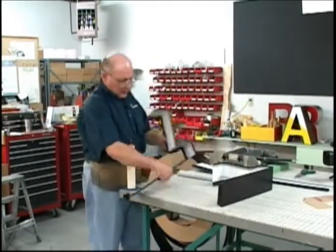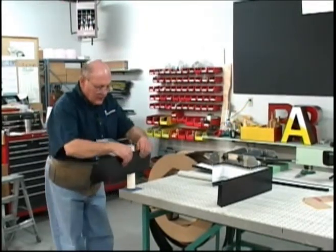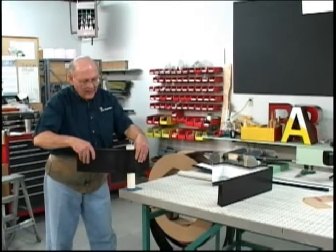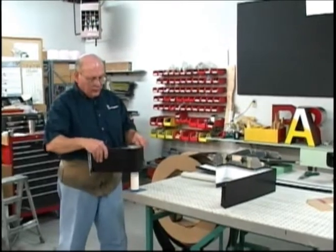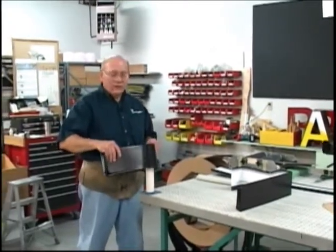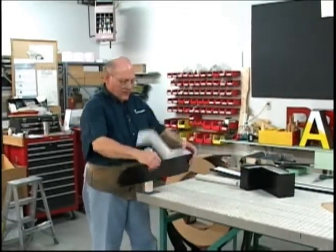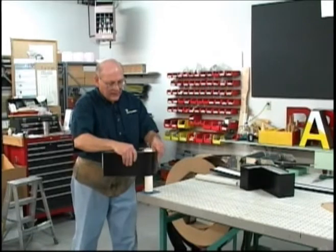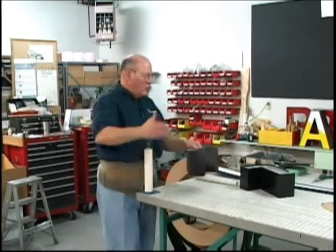And to perform the roll, we're going to position the beginning of the curve, the arc, against the roller and actually roll the letter edge, and then ending at the point where we have indicated to be the end of the roll. Same thing with the paper pattern. We have the beginning and ending of the arc, of the outside arc, and it performs the same way.